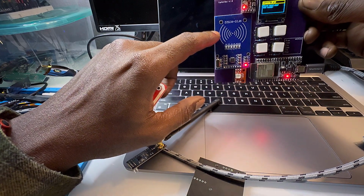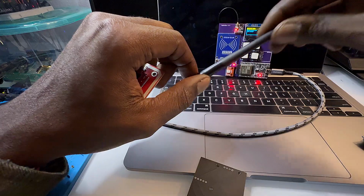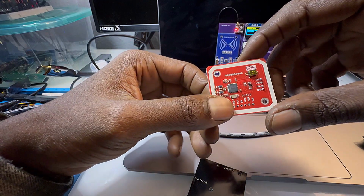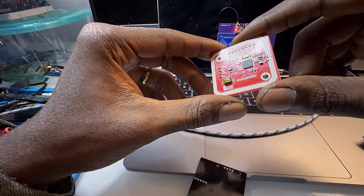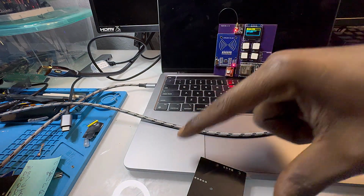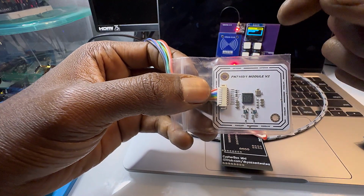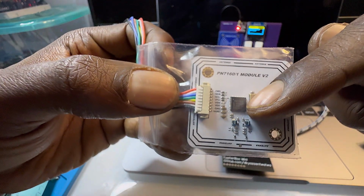So depending on what your uses are and how much you want to spend, you have that version. And then coming to tier 2, we have the PN532, and this is good because it does MIFARE 1K, 4K, and I think NFC 1 and 2. And that's what this CypherBox Mini will have. But then we move to Elechouse's best module that they sell. And all these chips are from NXP.